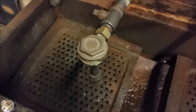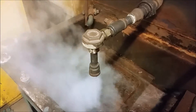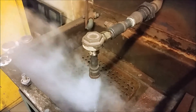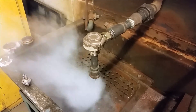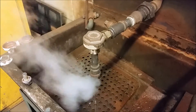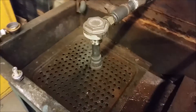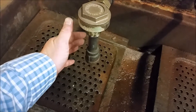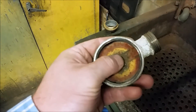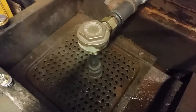Let's put some steam to this and see how long it takes to seal up. Let's call that pretty much sealed, although we're still getting a little steam blow-by. That's probably due to the fact that the seat down there in the body has obviously got some imperfections from being 100 years old. But I think that's probably as good as you're going to get.